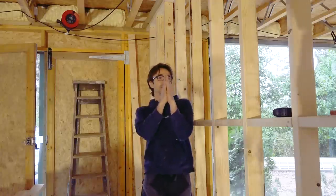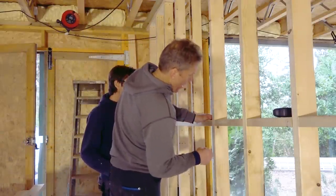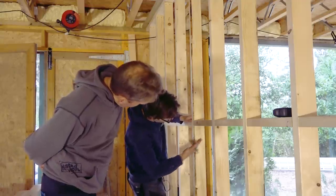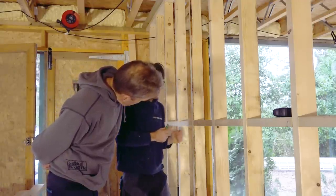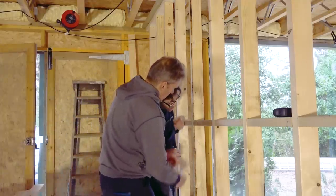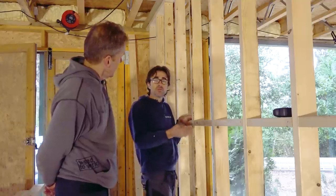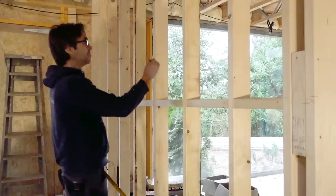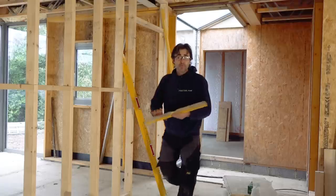You can just put a cut through and drive a screw back through here and that'll just crank it out from that side to that side. Cut all the way through, pop a screw back through. You wouldn't want to do it on all of them, though, because you might start weakening them all.